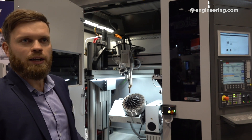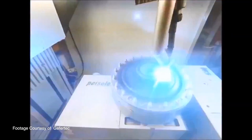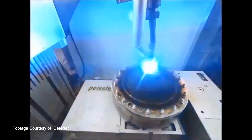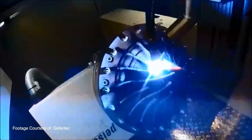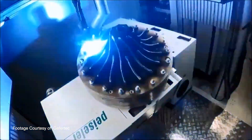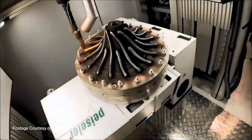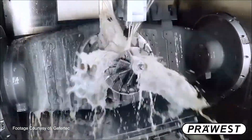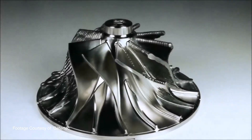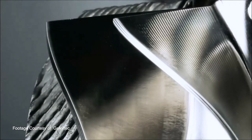The big machine is probably double the size. If you look at the parts we do, you'll see the staircase situation common in additive manufacturing quite clearly here, because we have quite thick layers — layer height is something between 1.5 and 3.5 millimeters, thickness 4 millimeters up to whatever you want. It's probably way rougher than other processes you might know. That's why we need machining on the majority of surfaces afterwards, but we see it as a very fast process. It still makes sense to create the part in two steps, because we save a lot of lead time in terms of reacting to design changes, and there's still less waste and less material to machine than conventional manufacturing.